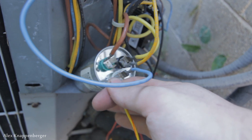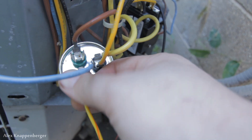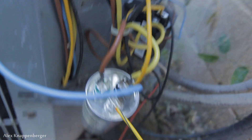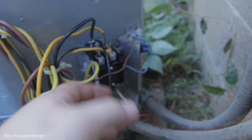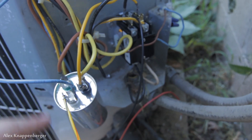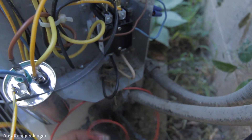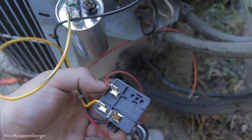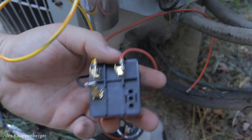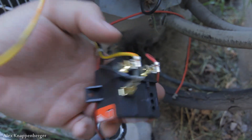It's going to go right here. All these run capacitors have extra connections. Trying to do this one-handedly is not ideal. So again: black wire goes to the black common side on your contactor; red goes to common on your run capacitor; striped yellow goes to the hermetic side. In case one of these pull off — on the relay, pin one is red, pin two is the striped yellow one, and pin five is the black one.